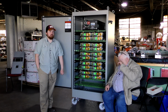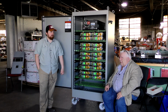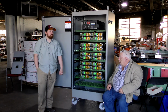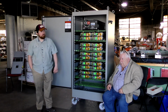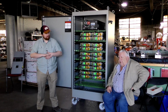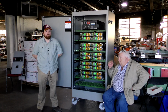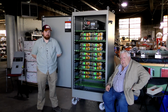That's kind of how it's designed. We're not really going to do that except in select cases. There is a thing called replication. On my Cadillac, for example, I wanted the fuel gauge to show the battery state of charge. And their gauge set is driven by CAN. I knew a little bit about CAN, not as much as I do now. But the time and effort to do that was not proportionate to the utility I would get from having a gauge in the dash that worked, because I can make another gauge and get it to work very simply with my battery. In other words, it's just too much time and trouble for one person.